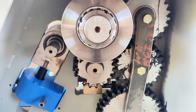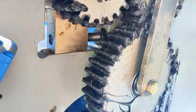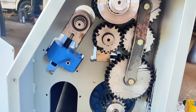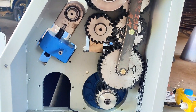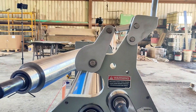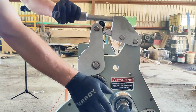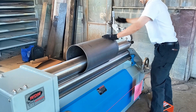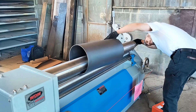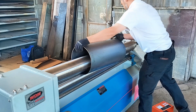It is also an all-electric design, which is great. It eliminates a lot of maintenance — no hydraulic hose leaks, no oil filter changes, no cylinders that are leaking down — so it's very robust in that respect. It also boasts a swing-out top roll. Instead of having a drop-in plate, these are slightly lighter machines and so they have a swing-out top roll that works fantastic for this application. It has a latch handle that has been redesigned and can now be unlatched under load, which is great.